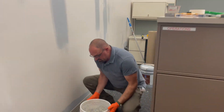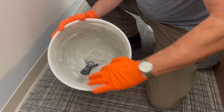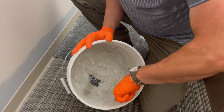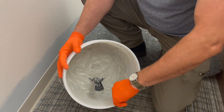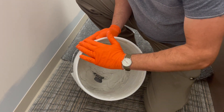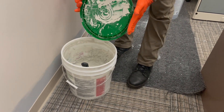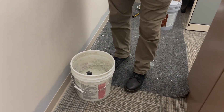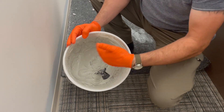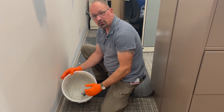Looking inside the bucket is one of the most important things with a used bucket of mud. If you're not using it all, mud dries inside. If you're not scraping the mud all the way off and you have mud drying up on your lid, when you go to pop the lid off, you're dropping everything into your mud. All that dry stuff will start falling into the wet mud, so now you're mixing wet mud with dry chunks — and when you go to lay it on a wall, you're going to be picking those chunks out everywhere and you won't get good mud laid down.